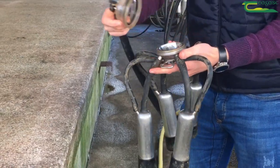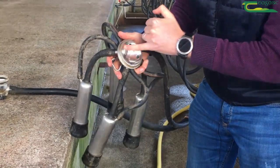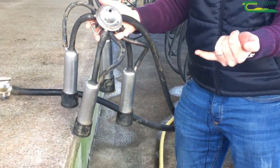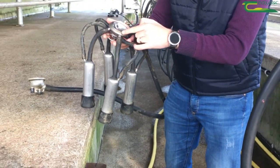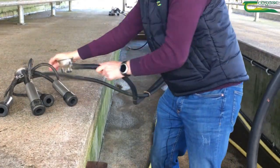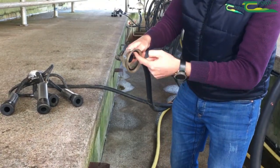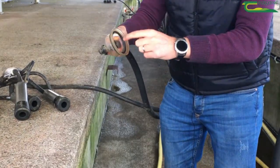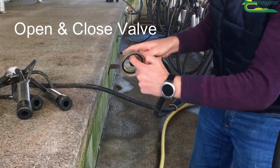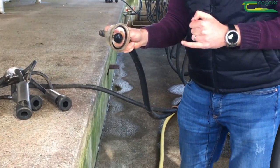The next thing is to look at the claw piece itself - first of all, see is there any filament around there. You can see when I rub my hand it's very, very smooth, so you can see that that is clean. You can see some dirt around the outside - it's just a matter of opening them and wiping them down. There are small bits of dirt but maybe not getting in direct contact with the milk. On the glass piece itself, the first thing I go after is the rubber - rub your hand along the outside and see is that rubber seal still in place and fully functional. You can see dirt around it. The next thing is the open and close valve - is there dirt along the inside? On these it's fairly clean on the inside, and when you rub your hand there's very little filament coming.